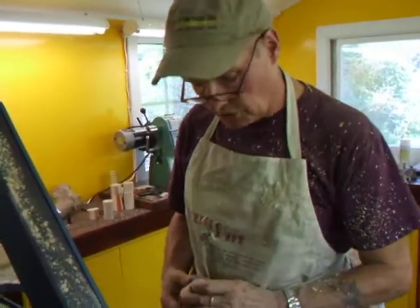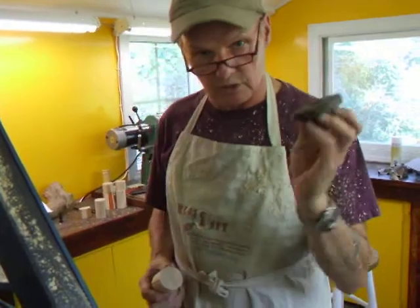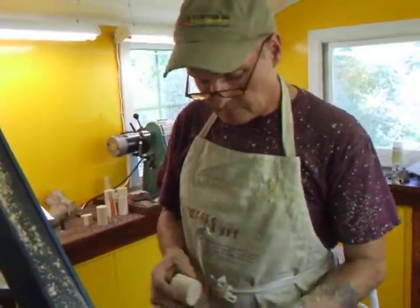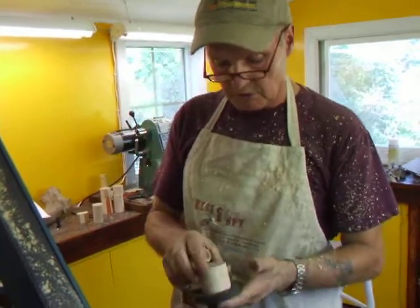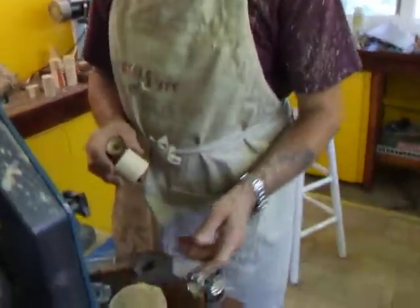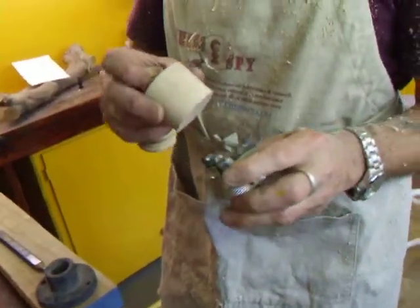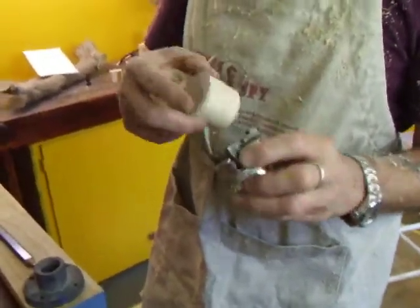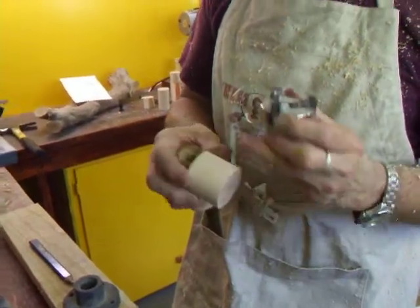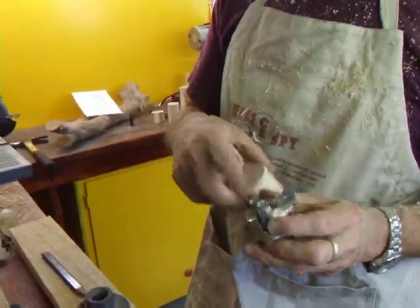With it on a glue chuck, which I'm going to make so I can glue it onto something like this, which is a faceplate. Rather than screw it on, which is one alternative, I'd have to have a smaller faceplate to screw it on for starters. Or I could hold it in a 3-jaw chuck, but that only holds on very small areas and it would damage the wood.